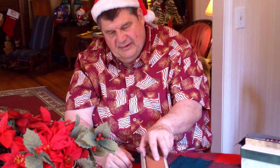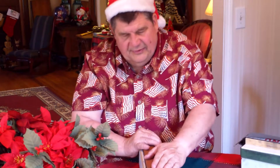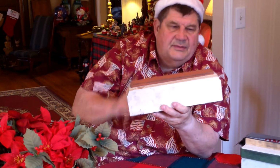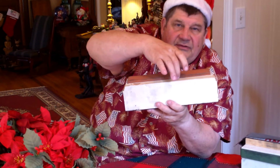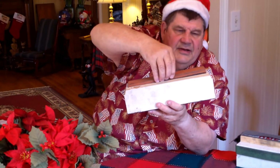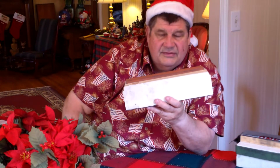And the stone fits down in there where about 1/3 of it, I guess, is down in the cutout here. And it works extremely well. If you wear the stone down too far, you could just cut out a piece of cardboard, put underneath this. That would raise the stone up, and you can get pretty much the whole useful life of the stone.